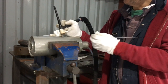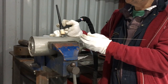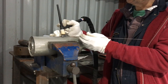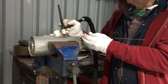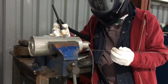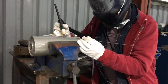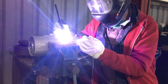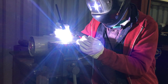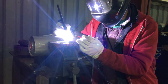Welding on stainless — if you imagine the heat spreading out in front of that torch and away from that arc, you don't want to let that heat get in front of you. You want to move at least as fast as it. Otherwise you can end up with a grey festering mess. I'm going to get really comfortable, I'm leaning on the bench, I've got my foot on the foot pedal, I've taken a dry run. I'm going to get my feed hand comfortable so I can feed. Light up, floor that pedal and I'm dabbing and moving in pretty quick time.